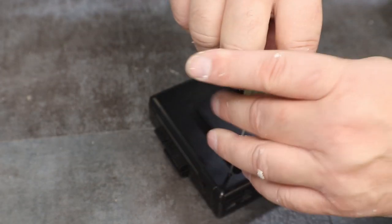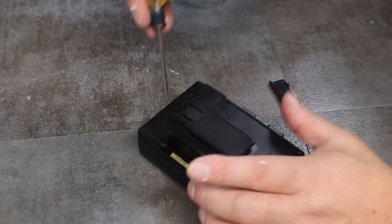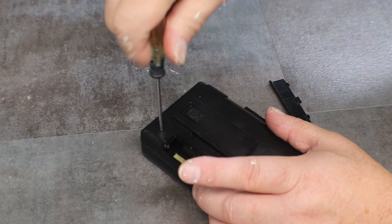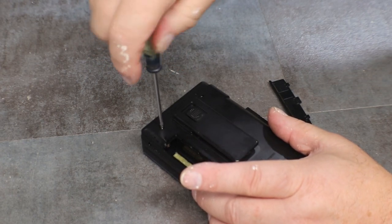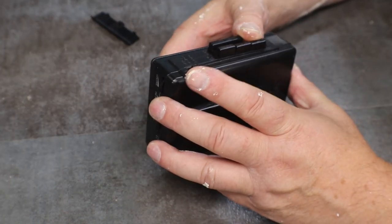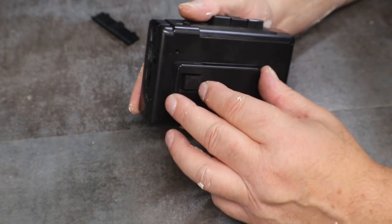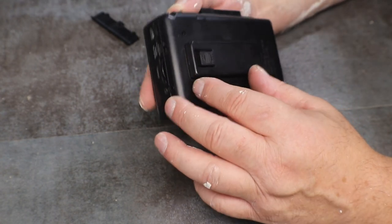You don't want to plug these in, or put batteries in them if there's a telltale sign of acid that has leaked out. You want to make sure that it's not on the circuit board. If it is, you've got to clean it off, because that's just a pathway for current to move through. And that's not good.